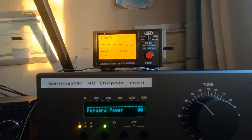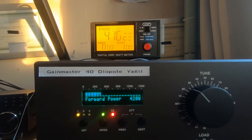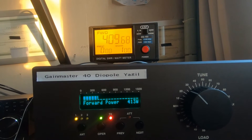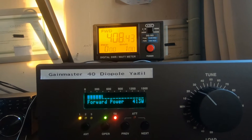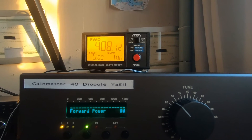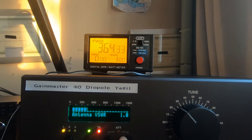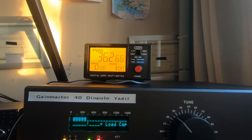That's too much for the system, so we'll flick it over to the higher range. Now I'm at 420, about 410 on the other — quite close readings. That's just about my legal maximum. Forward power and reflected — reflected reads nothing, and both meters are reading exactly the same. So really that's working very well.